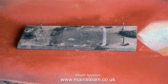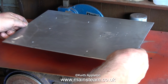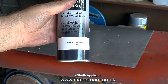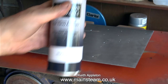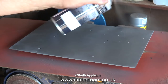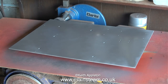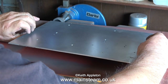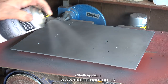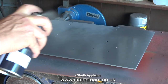This is a painting jig I made a while ago — just a piece of 6mm plywood with four panel pins hammered into it. It supports things I'm going to paint. The paint I'm using is self-etched primer, it's grey, and I get it from AutoPaint Northern. I'm painting the underside first, giving it several light coats for nice even coverage. It's a very warm day so you can actually see the paint drying. Once I'd finished the underside, I turned the part over and sat the painted side on the four pins. The pin heads will make a small mark in the paint, but that's on the underside — the visible top side is what I'm more concerned with.